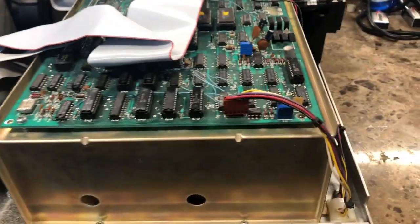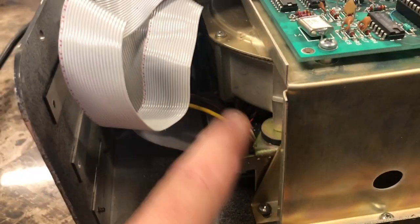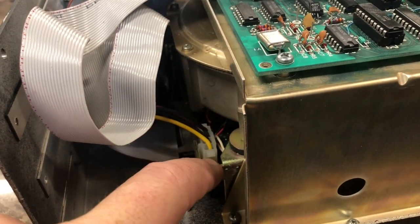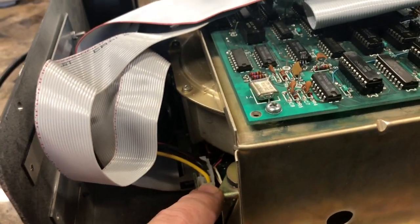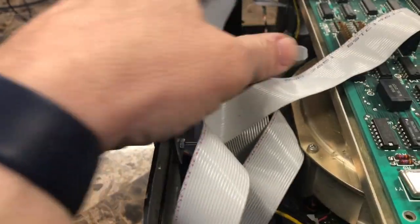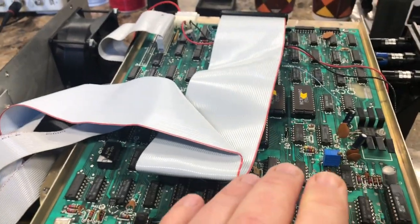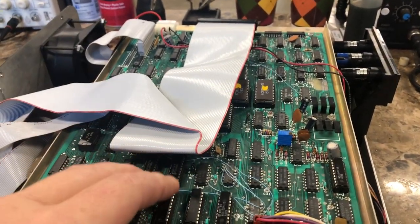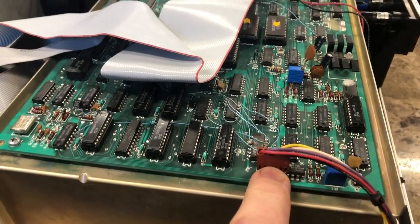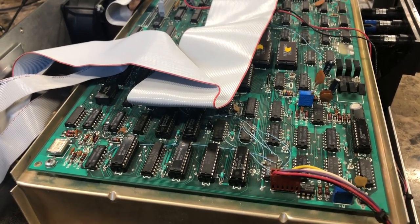Now, like I said, the green indicator light coming on is a great sign. What that means is the MFM hard drive is spinning up. It's self-diagnostic, saying that it's okay, and it sends that information through the two old MFM cables, these two right here, sending the signal to the controller board that it's okay. The controller board is apparently working so far, because the signal is getting to where the LED harness is, and it's sending an indication to the light that it's ready.